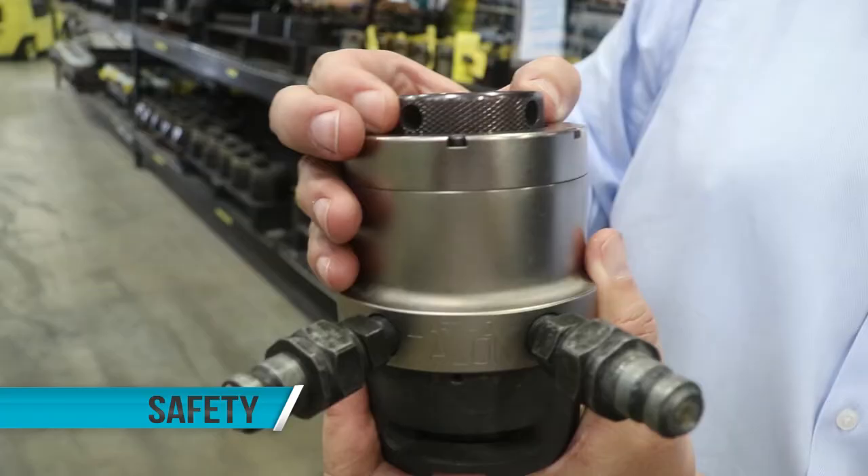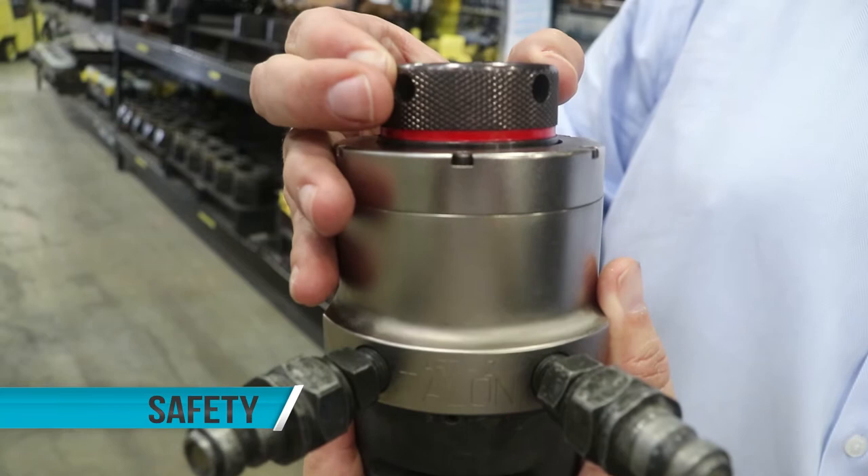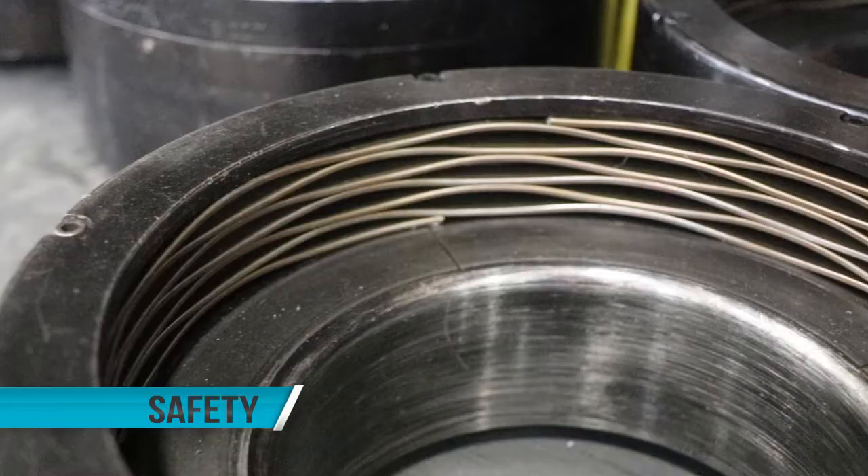There are two points to safety of the inner seal. The first one is overstroke, and the second one is just a simple failure of the seal. With respect to overstroke, we have a stroke indicator on the tool that shows the operator when the tool has become overstroked, and they know to go back down to zero stroke. If for some reason the operator does go past that point, the tool is designed to leak out at a designated point which is away from the operator, and the operator never sees the oil release.